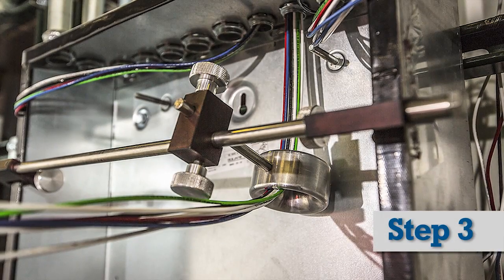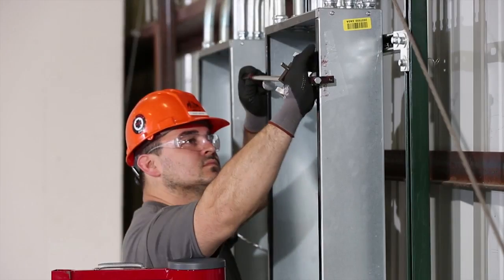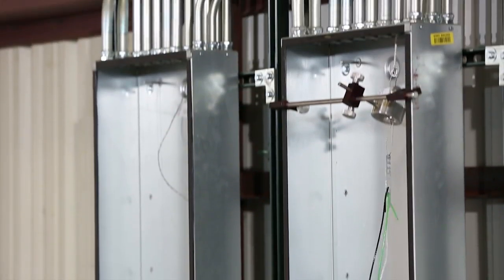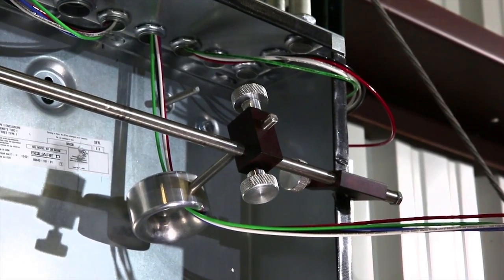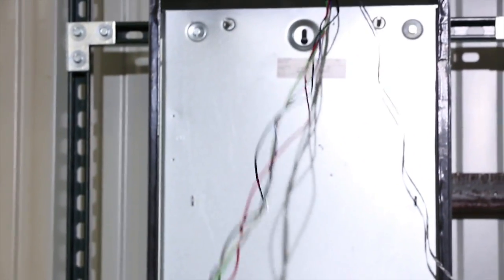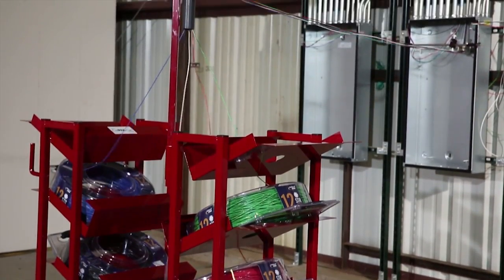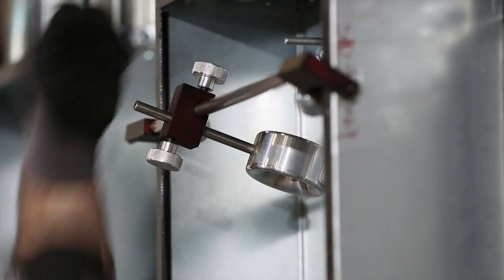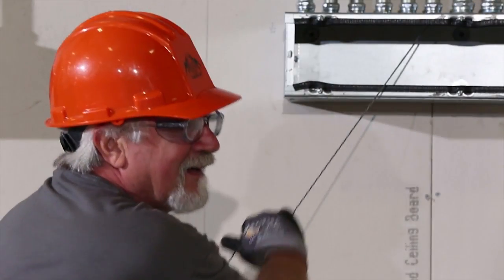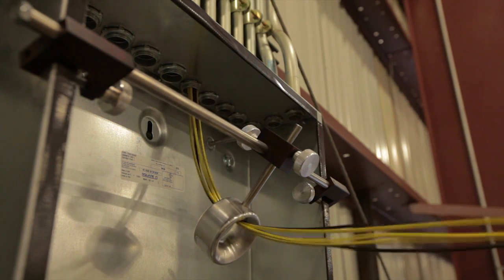Step 3: Feed the wire into the conduit. On many occasions, a guided circuit router can be used to guide the wire into a panel, pull box, or wireway and into a conduit. The guided circuit router ensures that the wires stay together as they are fed into the conduit, reducing the risk of tangled wires during a pull. It mounts easily to the panel can and aids in feeding conductors into the panel and conduit. Be sure the guide is aligned correctly to the panel can and feed conduit, as a misaligned guide can cause excess pull tension and added strain. Avoid wire feed angles approaching 90 degrees or more to further reduce pulling tension.